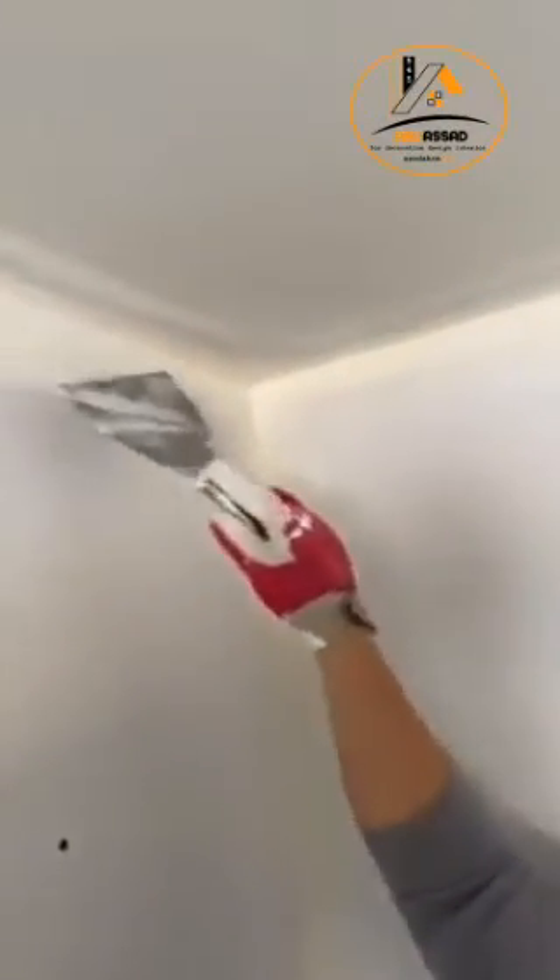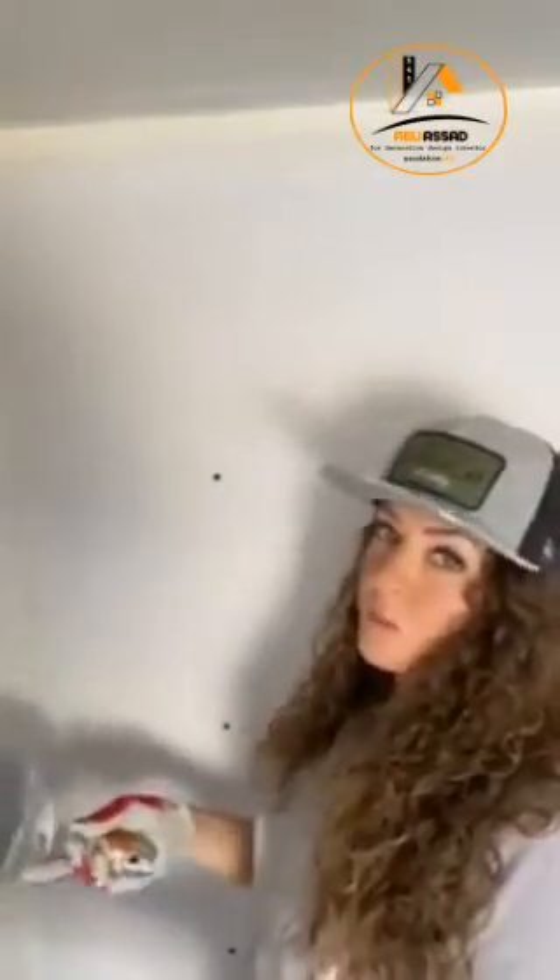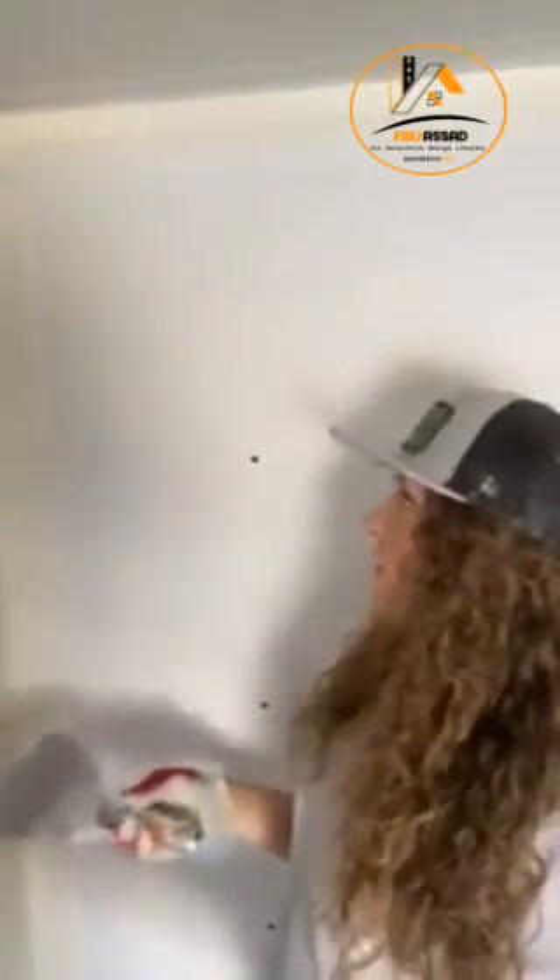But you don't want to get into any of these areas. As you can see, I kept it pretty tight. With a smaller knife, of course, you can get even tighter in there. But your angle head is going to leave your angles square, and you don't want to get in there and start digging out a bunch of mud because then you're going to run into a bunch of trouble later. It's going to be shallow, rounded out, all sorts of stuff.